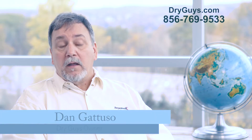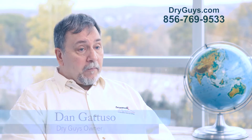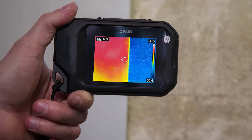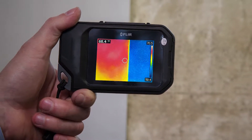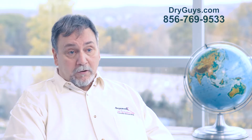People don't understand just how much heat is lost through the basement and through the rim joists. We use FLIR cameras that show the heat loss in the house — it's amazing how much heat is lost through the basement. This is my industry and I was shocked when I started learning all this. Especially up into the joist bays, where your floor joists meet your sill plate at the top of your foundation. That's where 60% of your heat loss is in a foundation and basement.